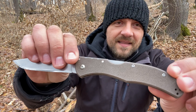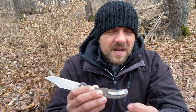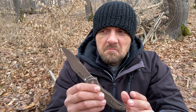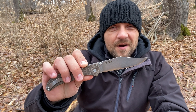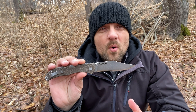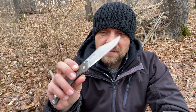The first thing I did to this knife was sand the scales underneath the pocket clip. These GFN handle scales have a bumpy texture — in the beginning it was fairly aggressive and I noticed it would rip my pockets. After sanding that area, the next thing I did was sharpen it. People on YouTube said 4034 SS is about 8CR13MOV-ish, and I would have agreed because it sharpened up quite easily to a very good edge, and I could keep that edge sharp simply by stropping.